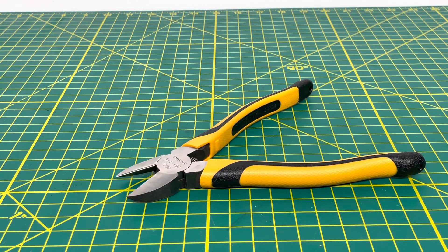Other than that, these are a fairly nice pair of diagonal cutters from Meri. Made in Japan, so they're always going to have a fairly nice finish and be a high-quality tool. I just don't recommend you try to use them for thicker gauge stuff or cutting multiple conductors at once. I don't know if they're induction-hardened or not, so I can't recommend trying to cut screws, nails, or hardened wire, as I'm not sure if the cutting edge will hold up long-term. I recommend you only use it with copper wire, aluminum wire, and other softer wires.